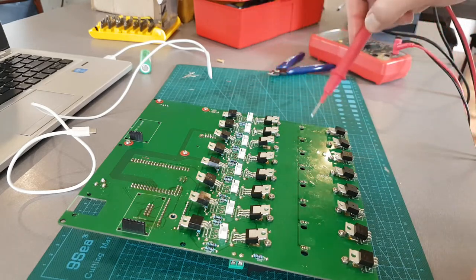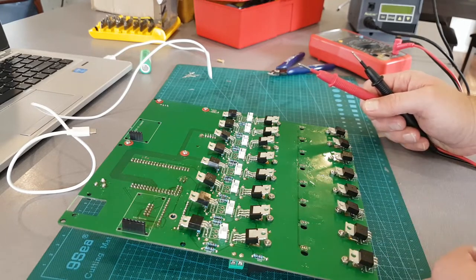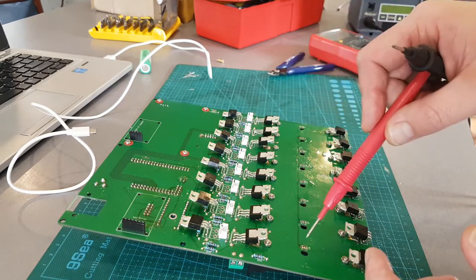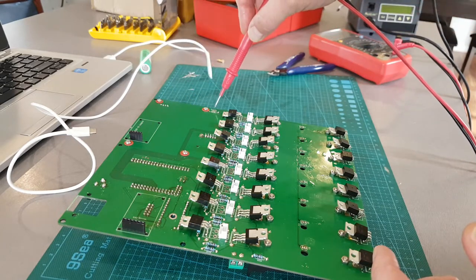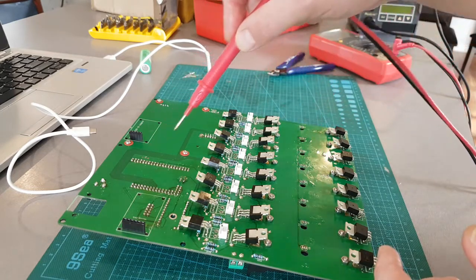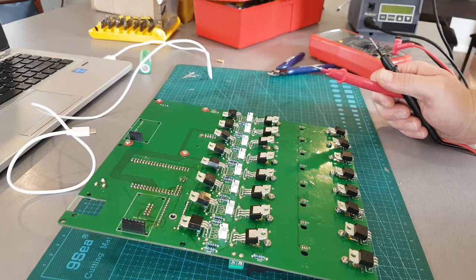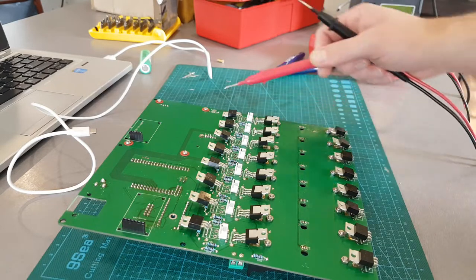Because you solder nine of them, you don't know where the short is unless you've got a microscope to zoom in. These are all connected together in parallel - the center pin is parallel, the positive and negative in parallel. This goes for the 5-volt up the top from the voltage regulator, and the bottom ground plane, all common. If one of these is back to front, that's going to stop the Arduino - if you've got a nano or something without protection, you're going to fry it. There was a bunch of smoke in the last video because two were back to front.